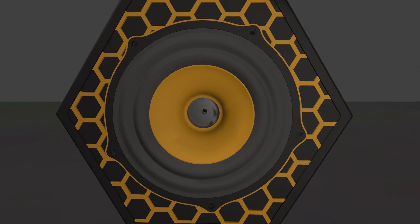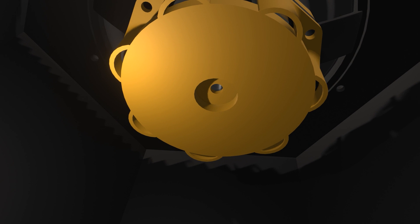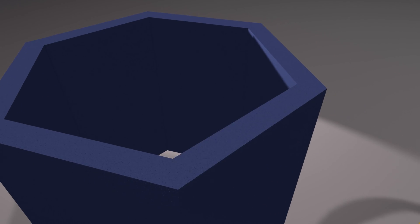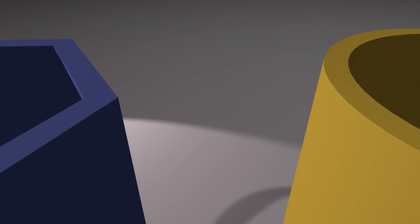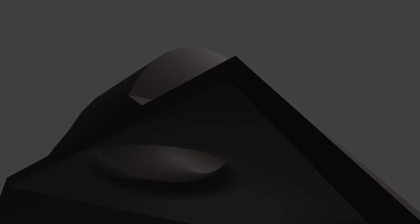This seems to help make a more efficient design by reducing mechanical resistance to flexing. The box is a hexagonal design. I went with a round internal port instead of hexagonal, because sharp corners inside a port can cause high airflow speeds in those corners and lower airflow at the center — those high-speed pockets of air can lead to chuffing and port noise. A round port is the easiest way to reduce that.